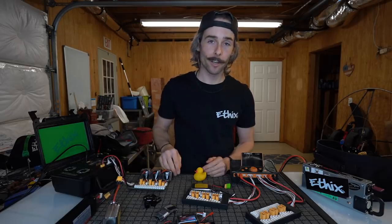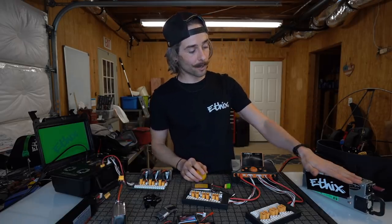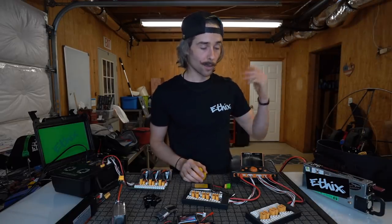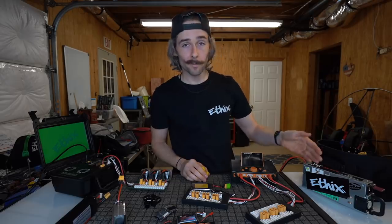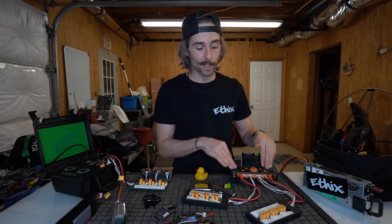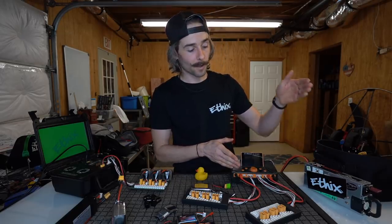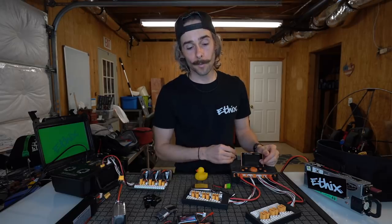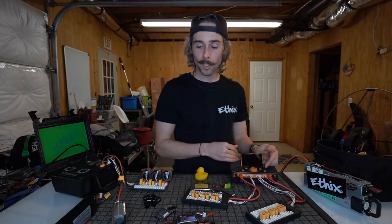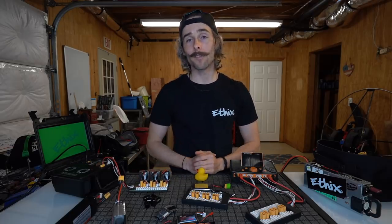These are not alternating current, these are direct current, because all batteries are direct current. So it's essentially a transformer, transforming 120 volts AC into 12 volts DC. You can do up to 24 volts and you can get more power to this. I think it'll do 40 amps per channel. So if you had a 24 volt setup, you would be able to do 40 amps per side. This is really for big helicopter batteries, and that's originally why I purchased it. But it works really well and charges a lot of these things in parallel if you're trying to do that.